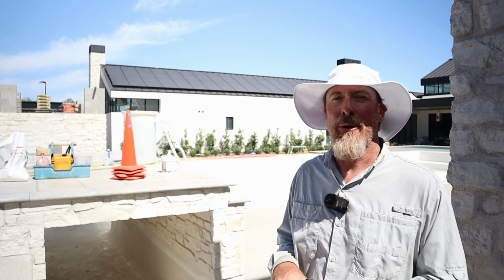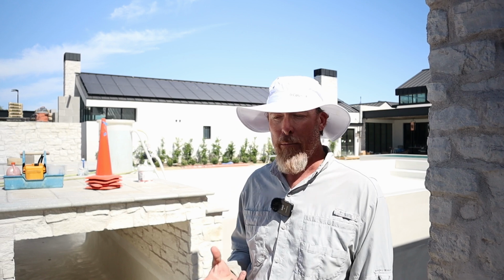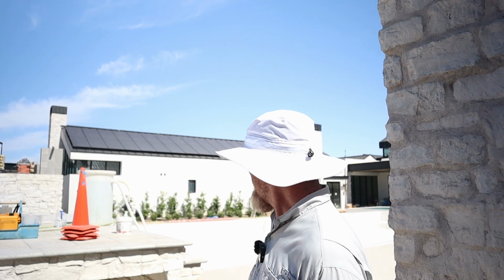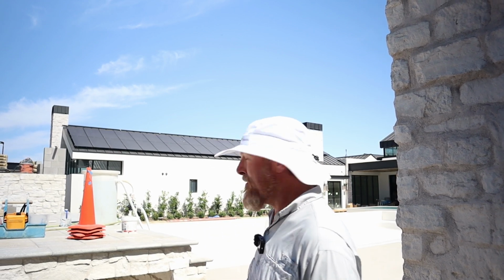With this pool, with regards to the barrel fill and adding the calcium, we want this pool to not have any dusting, because if we don't go through this process, we're almost guaranteed for that to happen. So really the outcome of this is to have a pool where we don't have to fight those challenges of getting rid of plaster dust, which is just extra calcium that's come out of the interior and laid itself on the bottom. When this pool's full, we shouldn't have too much of that. We will have a little bit because this was a pool that didn't get acid washed, and we just filled it right after install. So we should have a very clean surface, but also a surface that doesn't have any plaster dust, as it's referred to in the industry. We want to see a really clean and clear pool. That's really the objective of this in the end.